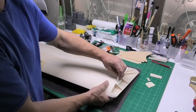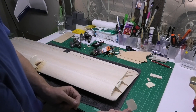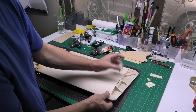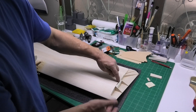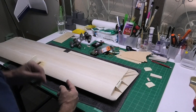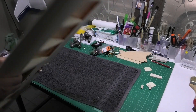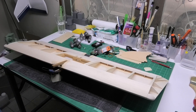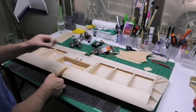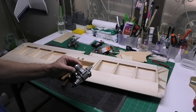I've decided I'll put some protection in here — I've put through a couple of pieces of balsa and bridged that with a six-mil quarter-inch piece of balsa, and I've got these three-mil plywood tip protectors that will just slot down into there. These are a really tight fit so I probably won't even glue those — they can be replaceable. If they start to get loose then I might just put a dab of hot glue. The covering can come down and fasten onto that. I'm just trying to make this more robust; it won't add a lot to the weight.